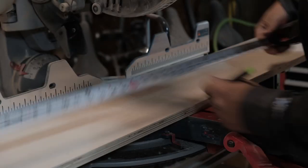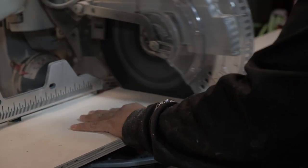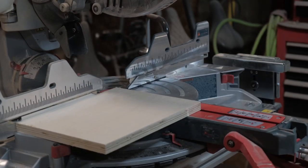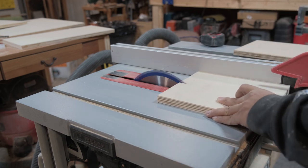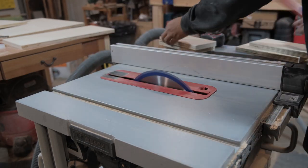I'm cutting the side panels at 20 inches, which will give me the nice dimensions I'm looking for. I also wanted to keep the charging station at roughly 10 inches deep, so I ripped this down to 10 and 3/4 inches. The pieces that hold the drill I ripped down to 4 inches, which gave me enough space so that the drills will sit in there nicely.